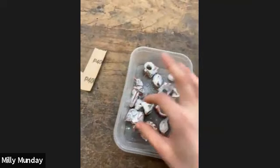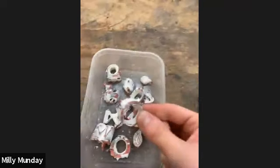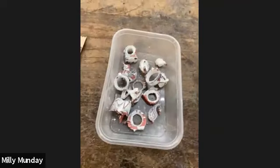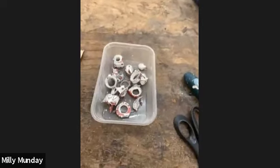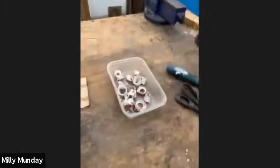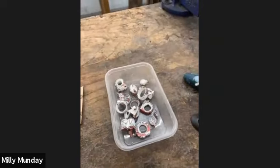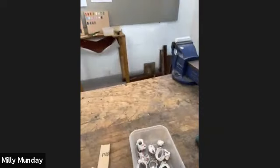How did they come out? They've all come out really well. Oh, wonderful. They all look like they've been really successful. But yeah, lots of cleanup. If you have time and you're able to book into the workshop, I would thoroughly recommend it, because using the sandblasting tool to quickly get rid of the investment is going to make that really quick. So that's what I'd recommend.